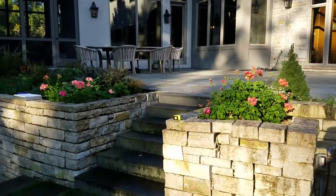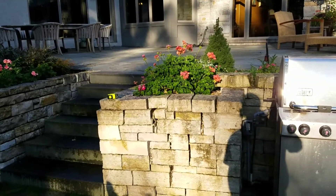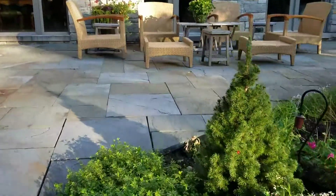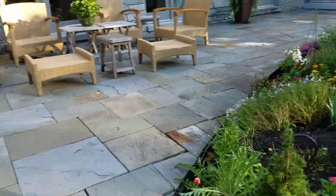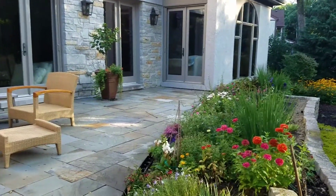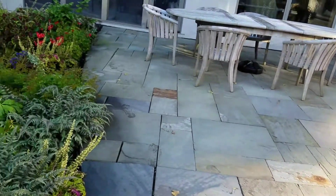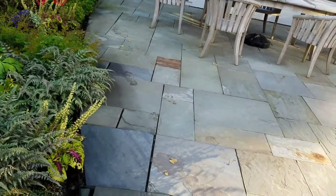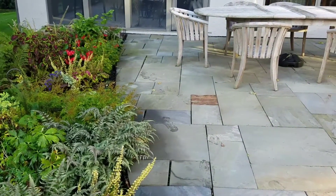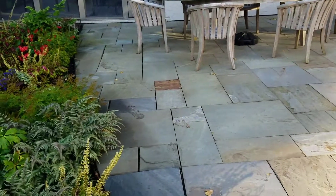The customer is looking to have some work done, some maintenance done on their existing walls and patios. Let's start with the patio first. This is a tight joint bluestone patio that was installed about 10 years ago and not by us. Underneath it is class 5 and sand, and these outside pieces are dipping down and sliding away. She wants us to come in and basically reset the last 4 feet and make it nice and level again.